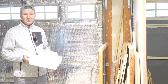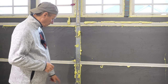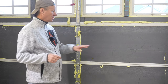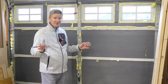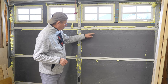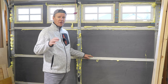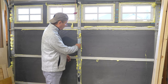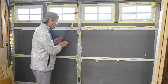It's really easy — anybody can do it. Here we are on the Styrofoam SM side. I needed three sheets, two feet by eight feet long, cut to size to fill here, and then the excess filled in up top. I measured from crease to crease where the garage door folds — whatever the distance, I cut it about an eighth to a quarter inch thicker. Try a panel first, you'll get the hang of it. I did the same thing on the width — sometimes there's a butt joint, sometimes there's a cavity.